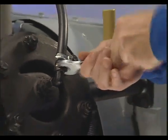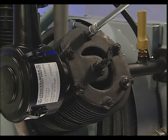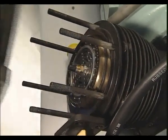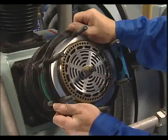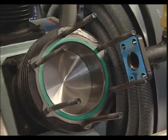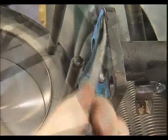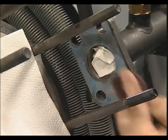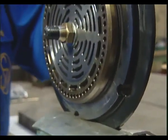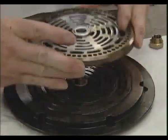Firstly, the pipe joints and hose lines on the cylinder heads, as well as the cylinder head nuts, must be loosened to remove the cylinder head. Then carefully take the valve out and clean all gasket surfaces thoroughly, again using care. The concentric valves are combined suction and delivery valves. The suction side is located on the inside. The delivery or pressure side is the outer annulus.